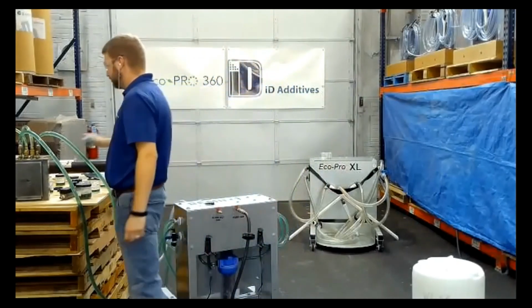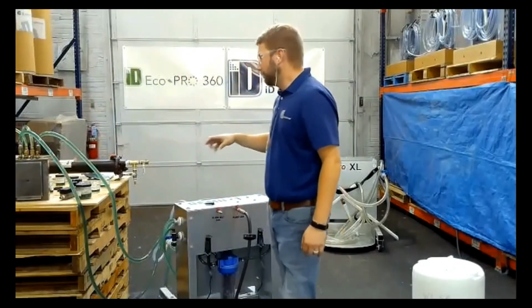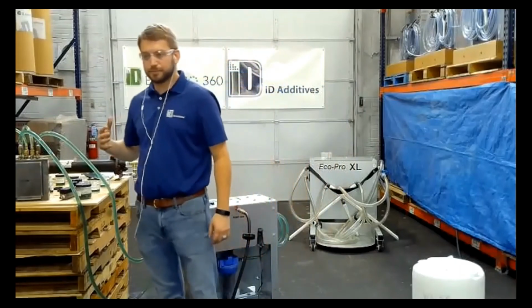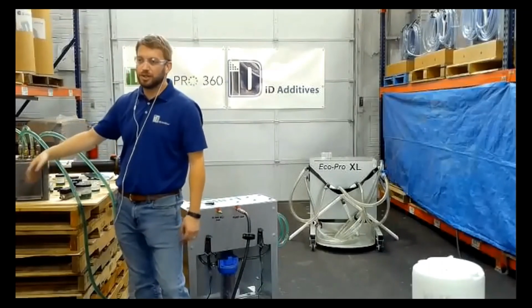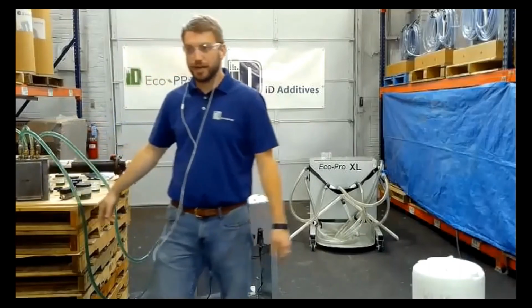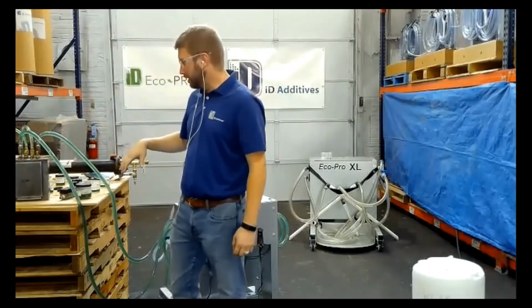But we still tell people, because you saw those alloys earlier, that it tends to darken the non-ferrous alloys over time. We still instruct people to backflush with water when you're done. Because I don't know, if somebody sends me a tool, we're not a traditional shop. I'm not tearing it apart. I have no idea what's on the inside of that. So I want to flush with water. That way I'm not staining any alloys that are on the inside.